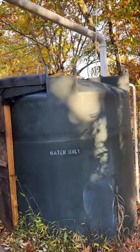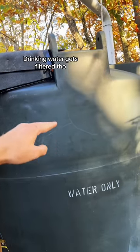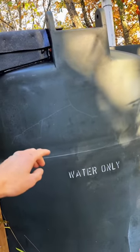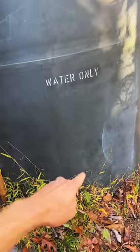To my knowledge, I'm the only person that has no filtration on the rainwater system after it leaves the tank. The water pickup moves with the level of the tank and picks up about 18 inches below the surface. Anything floating on top doesn't get into it. Anything settled on the bottom doesn't.